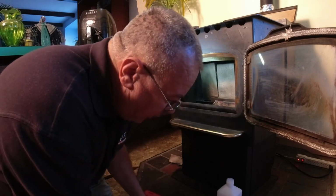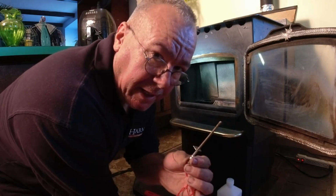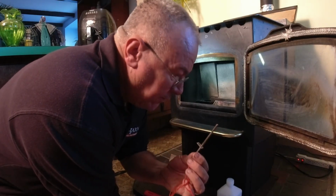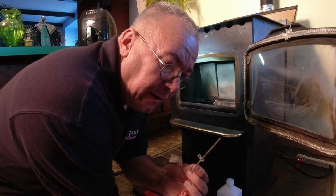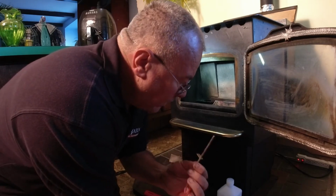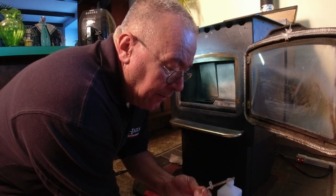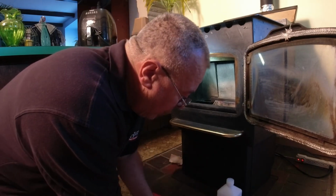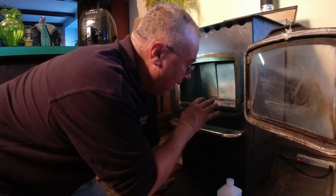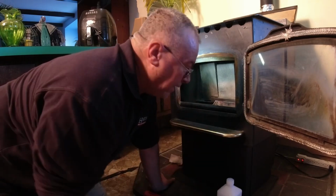And that big alcohol flame heats your temperature sensor. It's called an ESP probe. It's your only temperature sensor that does everything. It lives right next to where your exhaust comes out, on the back of the stove. Once this gets hot enough, it's going to start feeding pellets, and it's used when it shuts down and everything else. But my point is, if this gets too hot right now with a big alcohol flame, and it says, oh, we're hot enough for pellets, then it'll start feeding pellets.